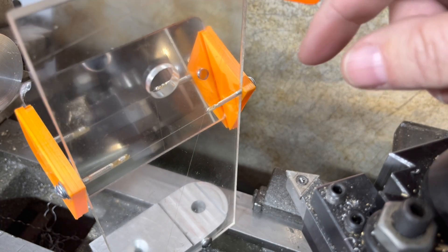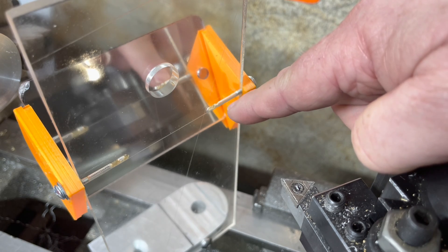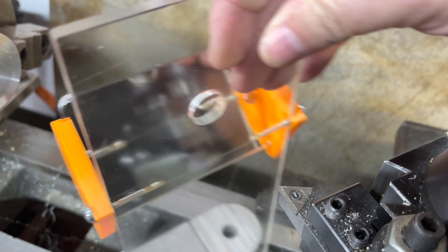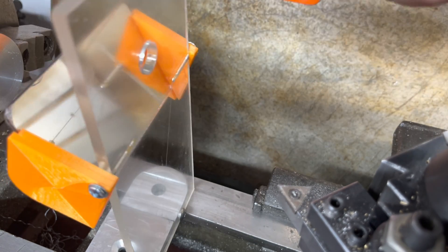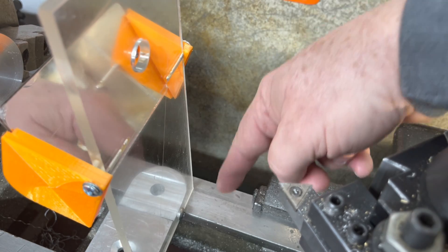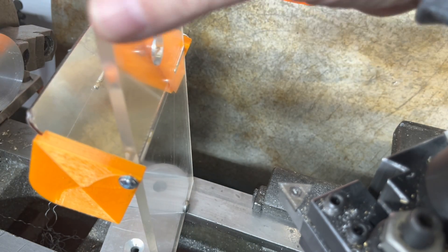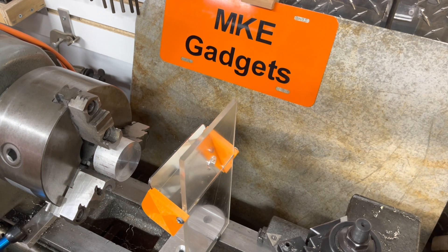This unique tool turned out pretty good. I made a couple of mistakes: I shouldn't have drilled a hole that close to the line, and I shouldn't have drilled and tapped the mirror-holder holes on the center line. But I'm going to use it for a while — I can always make a new one. The Lexan I got for nothing, the mirror holders are 3D printed, the aluminum came from my scrap box, and the only thing I really bought were four screws — two for the mirror holders and two to hold the Lexan to the aluminum base. All in all I'm very happy with it. This is MKE Gadgets — thank you for watching this unique lathe tool height setting gauge video. Please support the channel by subscribing. Thanks, we'll see you next time.